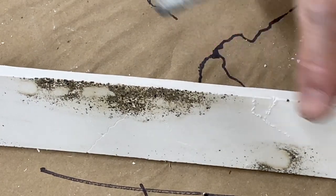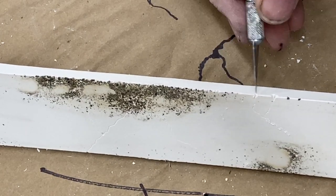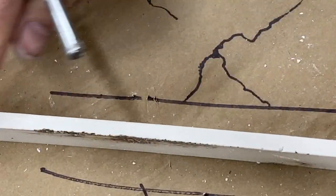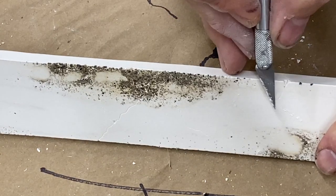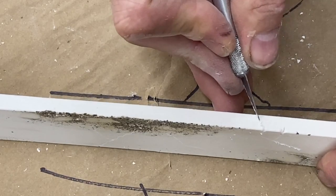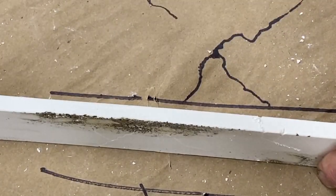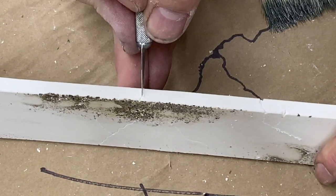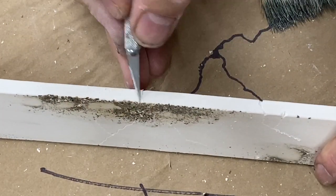I'm taking out some chunks where water might collect. The top edge of the wall is pretty important as well — we don't want it to be perfectly clean. Whatever cracks are coming up the wall should find their way across the edge, and this will break up the monotony of one solid piece of concrete.